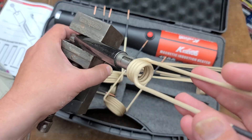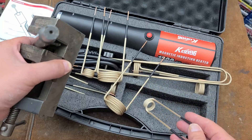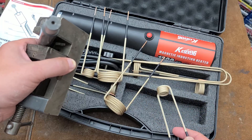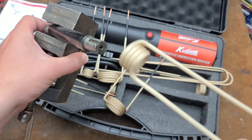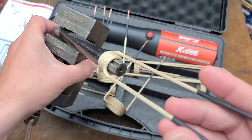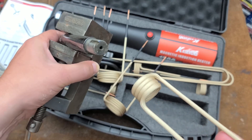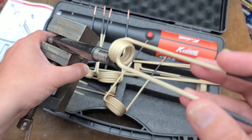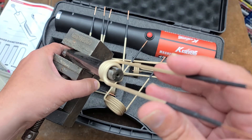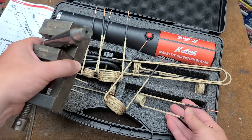Like transformers, these things work much better the tighter the fit, or the closer the coil can be to the magnetic objects. Just like an induction cooktop, it does have to be a magnetic steel. These will work on magnetic forms of stainless steels. You can induction heat things that are non-magnetic — brasses, coppers, aluminums — but you need an overwhelming amount of power. Where if the material is magnetic, you get a resonance going and it heats up much more effectively. That's why these are rated for ferrous metals. The less of the air gap, the closer the magnetic field is, the more energy that you'll deliver.